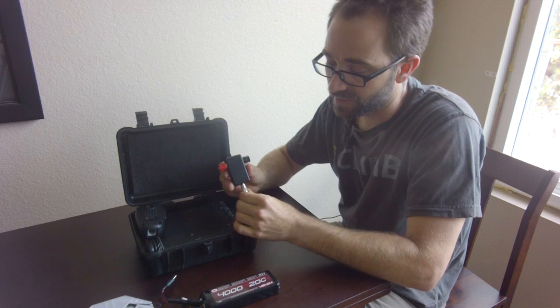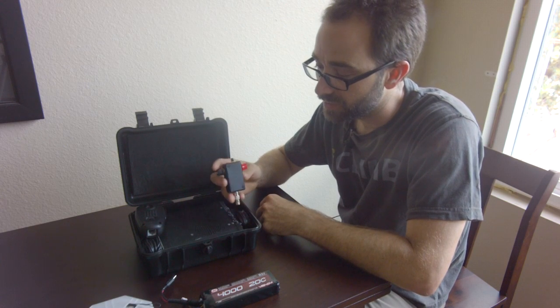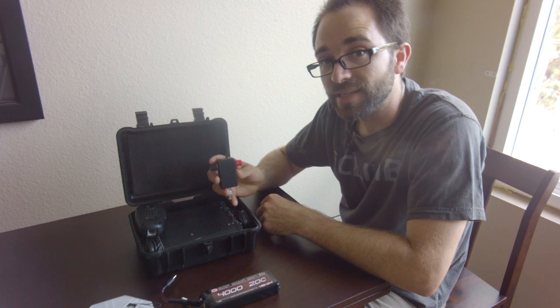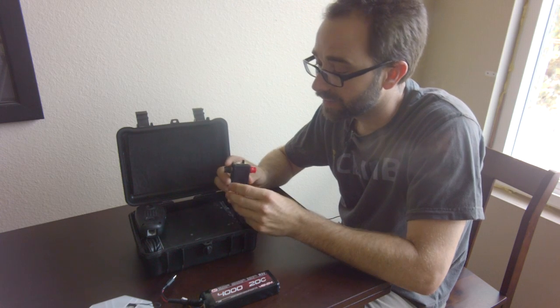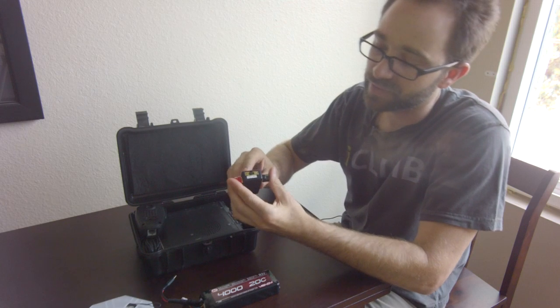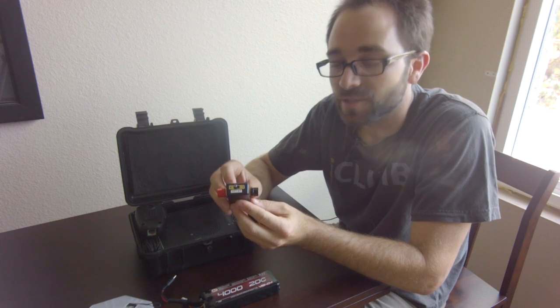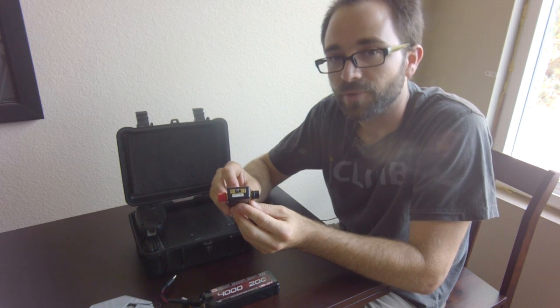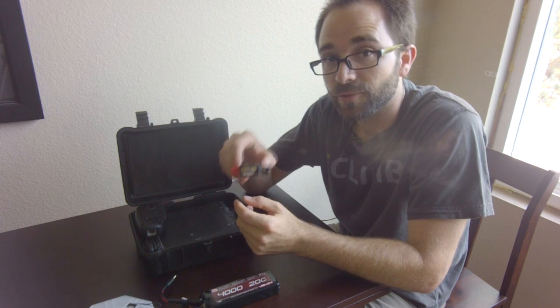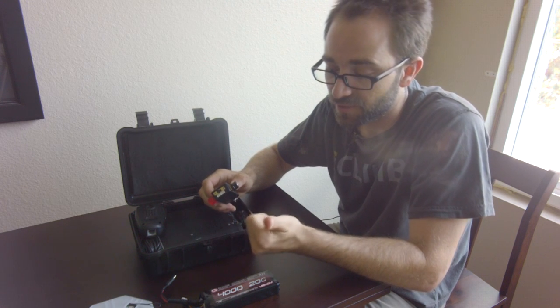To go with that antenna, I've got a QRP balun. I believe these come from qrpkits.com, and I sort of modified the design on this one. I put a switch on the end of this that lets me switch it between a 1-to-1 and a 4-to-1 balun. The way I've got the off-center fed dipole set up, the 4-to-1 works great with 10 through 40 meters,